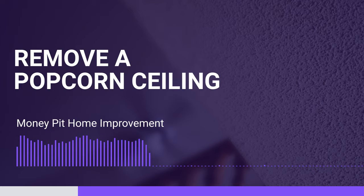Removing a popcorn ceiling is a pretty messy job, but generally the way it's done is you want to spray it down and get it pretty wet, then take a spackle knife and very slowly but surely scrape that away. The problem is that even when you get all that popcorn away, it's still going to be fairly uneven, so you won't be able to paint it flush and have it be perfectly smooth.